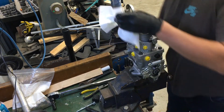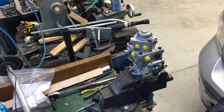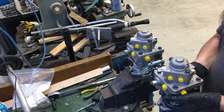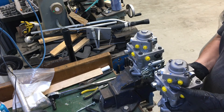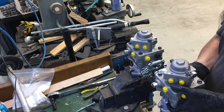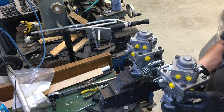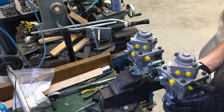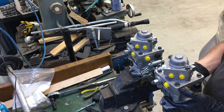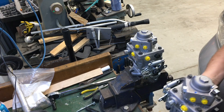Maybe a little brake cleaner will help. We'll degrease this later on, but for now that's about it. So we have two pumps, and the other one's already been switched for counterclockwise rotation. Both control levers are in the middle — that's going to be good. The work ports are all along the back here so this will face the front of the machine, and the auxiliary pump work ports are both on the same side so we can connect them together for other fun stuff — maybe like a blade or something. There you have it.